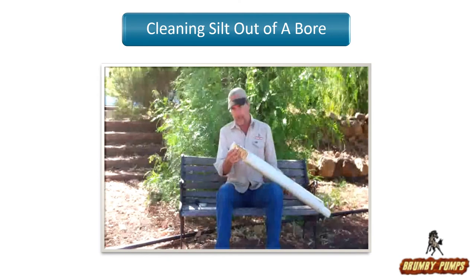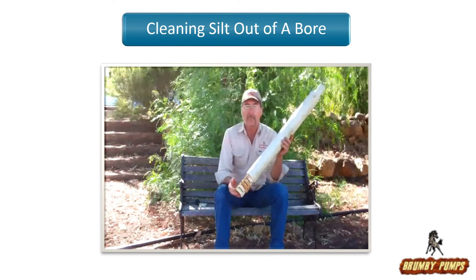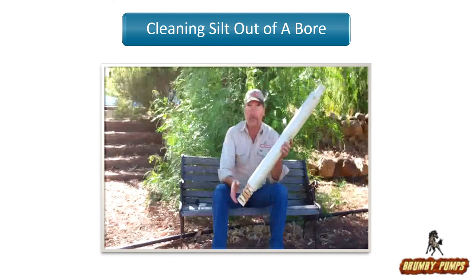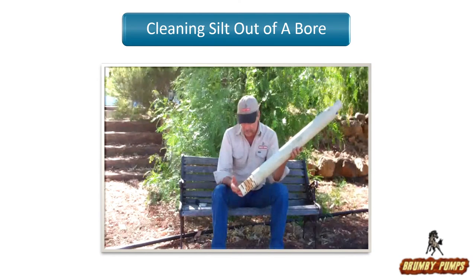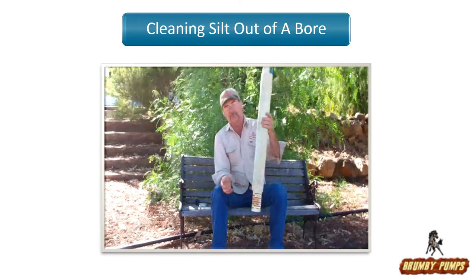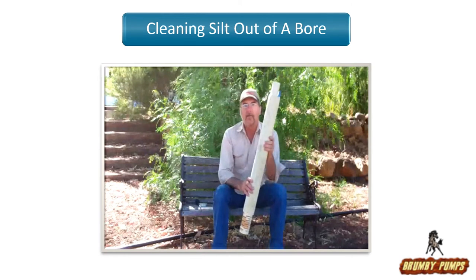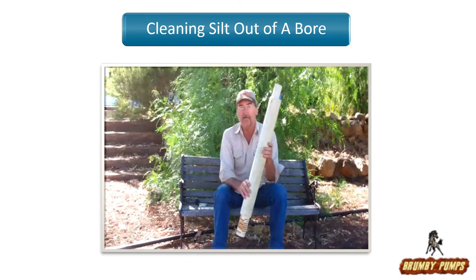So we take this off so the bottom is open, and then we reinstall the pump just as we did before, but we need a bit of extra piping at the top because we're going to push it down further. So this can be pushed down into the silt, jiggled around, stir up the silt, and it'll just pump it up, and you just keep feeding it down as your well gets deeper, and you'll see in a minute just how that works.